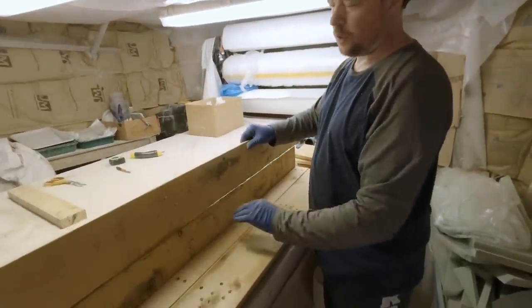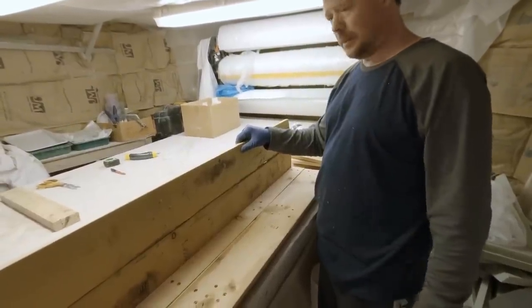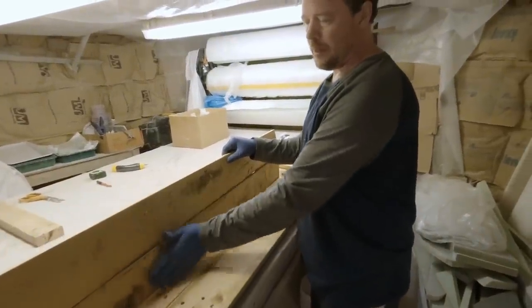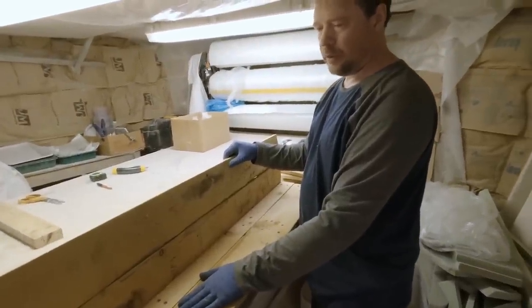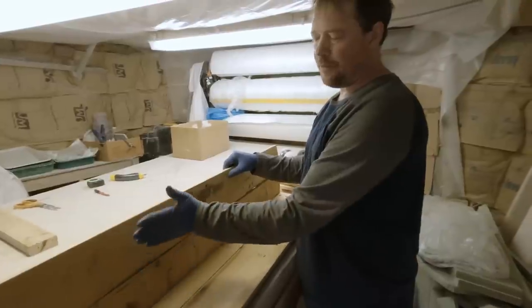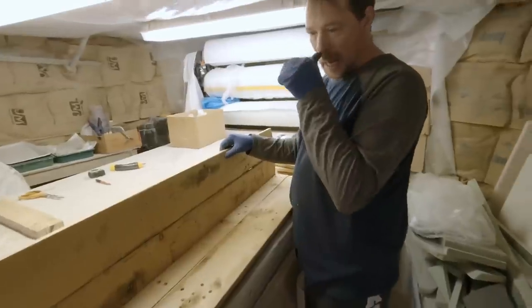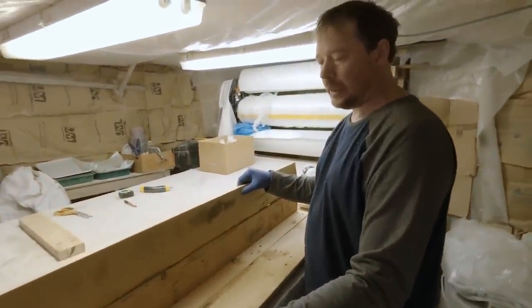And after we get the form made, then probably just cover it with maybe some tape, and we'll cast up a couple of layers. We'll laminate a couple layers of probably like some 2408 on here, and it'll create a form, and then we can trim it for the width and the height of our sump, and then we can tab it into place.